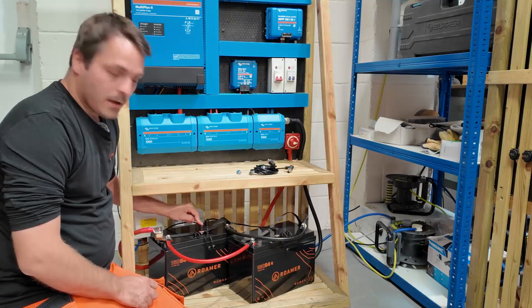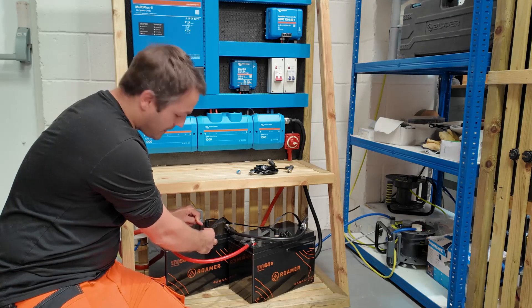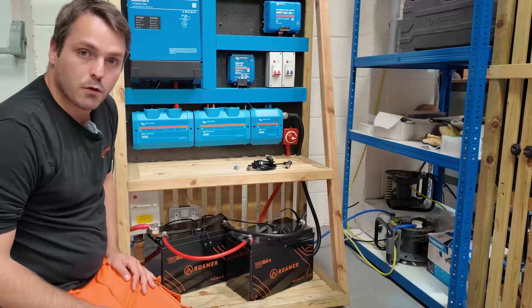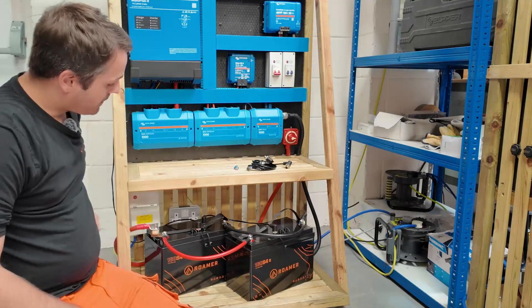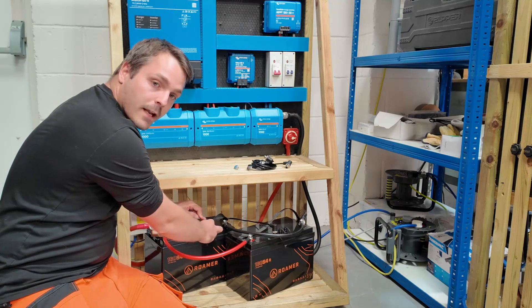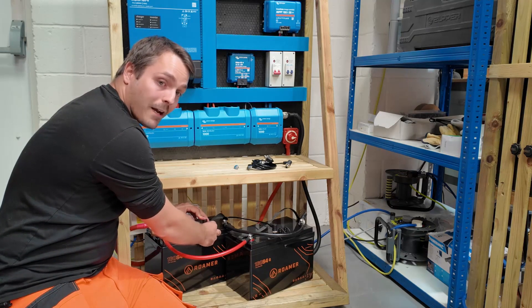Or out from the battery if it's a seat base. With the connector on the top of the battery, push down lightly and rotate the collar clockwise. You'll feel the cable being pulled into the connector as you screw it in. Keep light pressure and keep turning clockwise until you can turn no more. If you have two or more ROMA batteries, you'll be supplied a link cable which has an M12 connector on both ends. The same applies as with the CAN bus cable — cable pointing towards the middle of the battery. Place it on top, screw the connector in; this will be on one of the outer two ports compared to the CAN bus connector. You'll need to do this at both ends on both batteries.